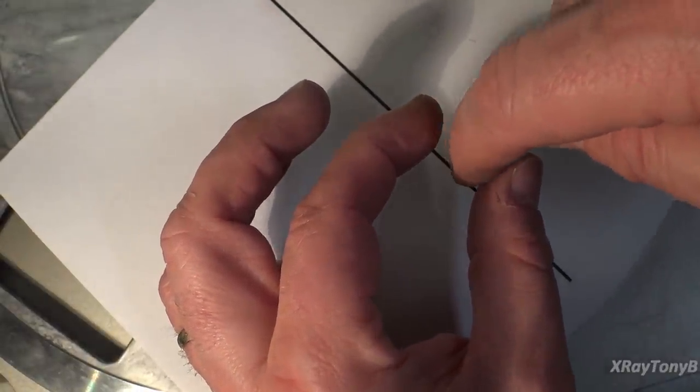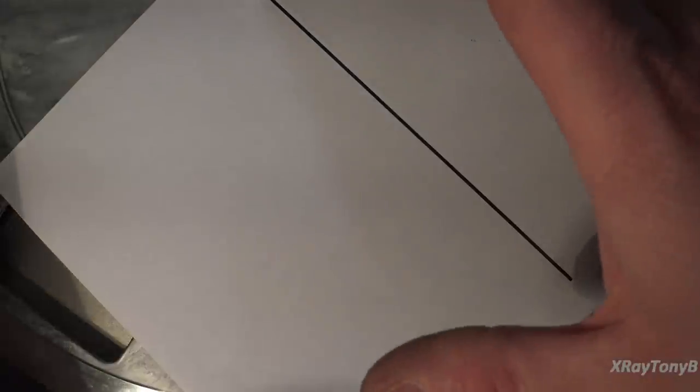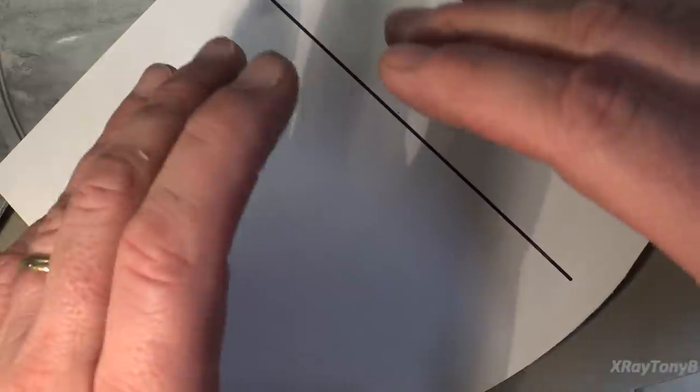So that's going to affect your stereo separation. Now on a really cheap low-end turntable, you won't necessarily notice it as much, but as you get to higher-end turntables and higher-end cartridges, that starts to become a factor. The other reason that the turntable needs to be level: if it's not level, that little tiny bit of weight is actually going to shift that stylus a little bit in the groove, and it's not going to track dead center of the groove.